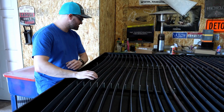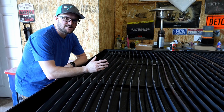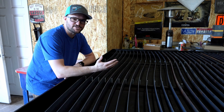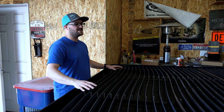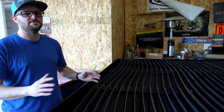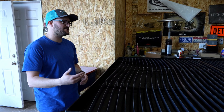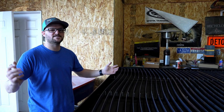It was a lot of work — I'm pretty much done with wanting to drill and tap holes. Those new Icon tap and dies came in super handy because I used one tap to do all of this and it's still perfect. Just make sure you use cutting fluid and it'll last you forever. We got the slats done and the upper trays all sealed in, and then a ton of painting. This thing was a nightmare to paint. I was really wanting to have it powder coated, but we didn't have the funds for that, so I went the spray paint route.